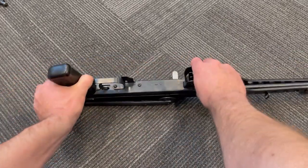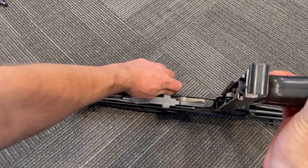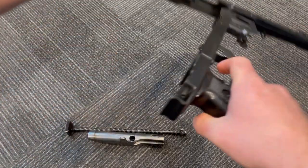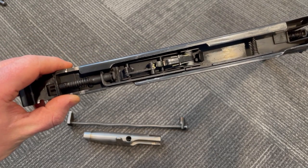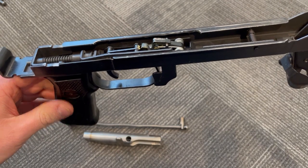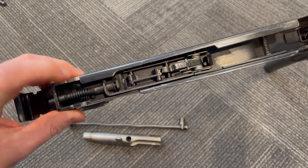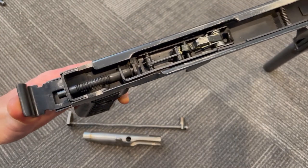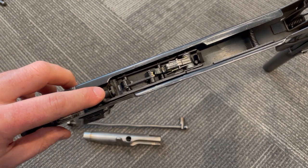I'll take apart mine right now. There's a little foot in the back that opens up, and in the back here you can see the denial bar, which doesn't allow a full automatic bolt to cycle. We'll take out the semi-automatic bolt and the semi-automatic recoil rod. Flipping it over to talk about the fire control group — as you can see, it's not the full automatic fire control group anymore; that's been completely stripped out of the lower. This is a drop-in unit with a hammer. Once you pull the trigger, the hammer goes forward, hits the back of the bolt striker rod, and hits the firing pin, resetting semi-automatically. One thing you'll have to do is weld this little piece into the bottom, because the spring needs somewhere to back up to. You need to cut that out of the original bottom plate and weld it into the bottom of the receiver.